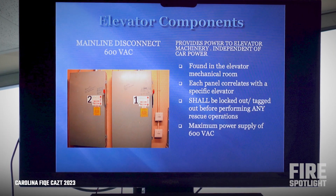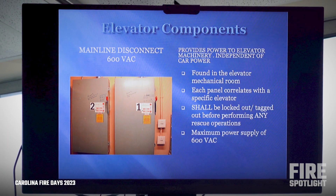Electric traction for hydraulic is going to be two separate disconnect places. The mainline disconnect is going to be the larger of the two boxes. So up to 600 volts — the majority of what we're seeing is 220, perhaps some bigger elevators in other places up to 600 — but the high voltage, line voltage side of that is going to be the larger of the disconnect. That's the one we're aiming for when we get into the elevator machine room.